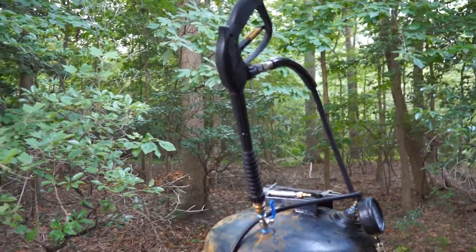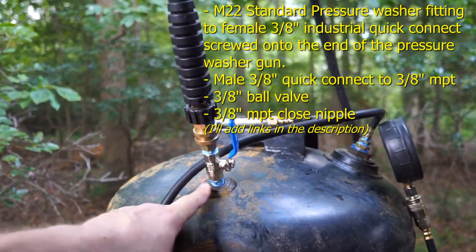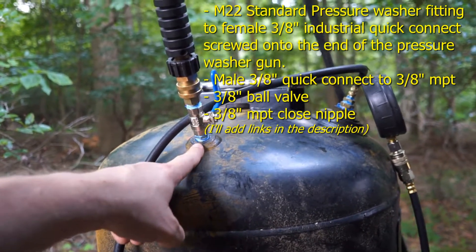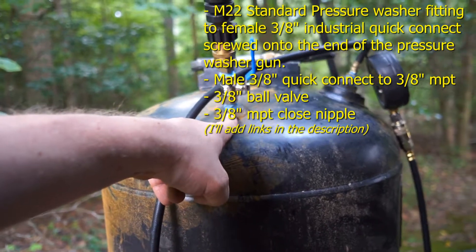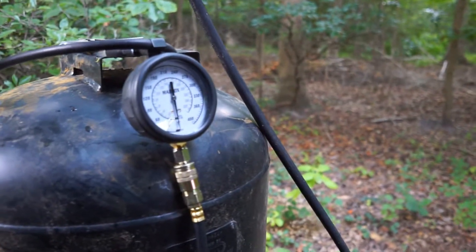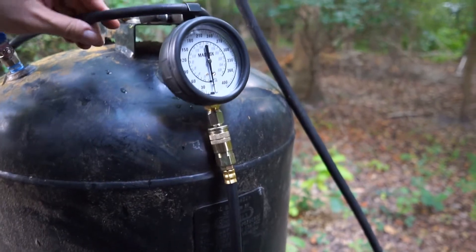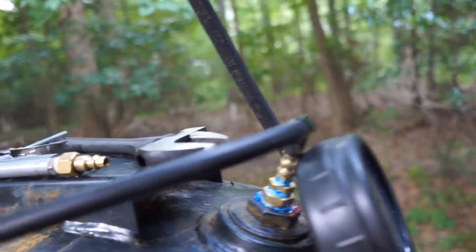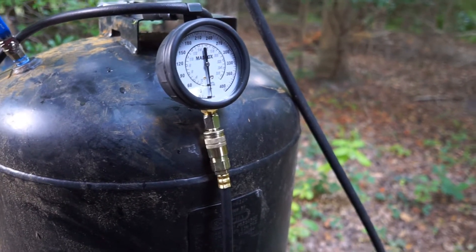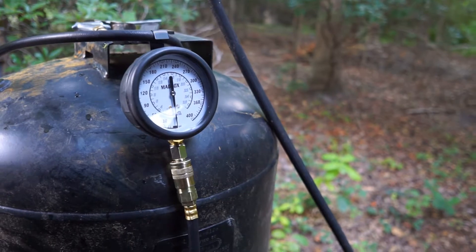What I did is I found a quick-connect fitting that I could thread into one of the top fittings here — that's the quick connect right there — and then a ball valve here, an adapter, actually just a male-to-male three-eighths. On this side I've got a pressure gauge intended for testing various automotive stuff. It basically has a long hose and a quick connect to hook up the gauge. It goes to 400 PSI. Since my compressor is supposed to pressurize the tank to 150 PSI, I want at least a two-times margin, so I'm probably going to test this at about 300 or 350 PSI.